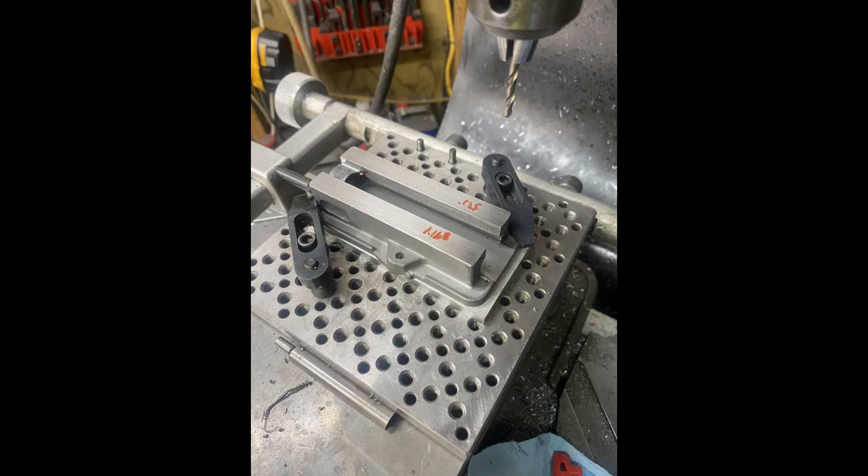This is a photograph — I've already started working on the unit. You can see the vice bed is on the pallet and it's got a sacrificial piece of aluminum underneath it. There's a stop on the far left side and the vice is pinned down. You can't see it, but there is a quarter-inch hole with a quarter-inch dowel going into the aluminum plate. I've already checked the alignment, so everything is on center and running true to the mill. The couple of red marks you see are the layout for the holes for the fixed jaw, which I am getting ready to drill.